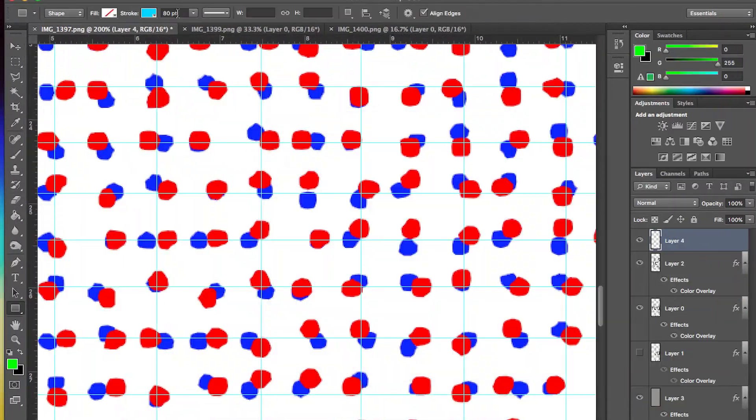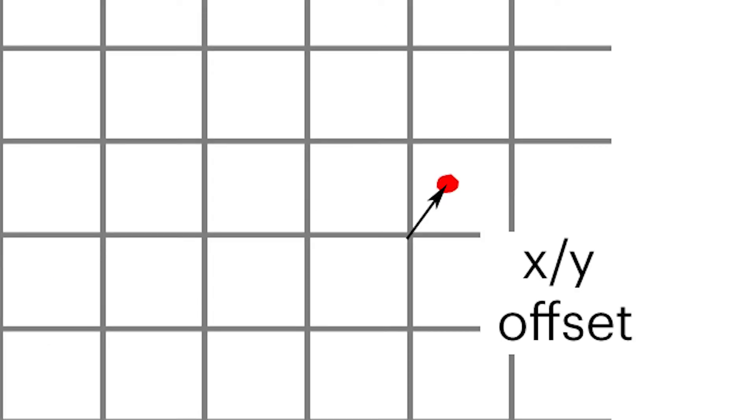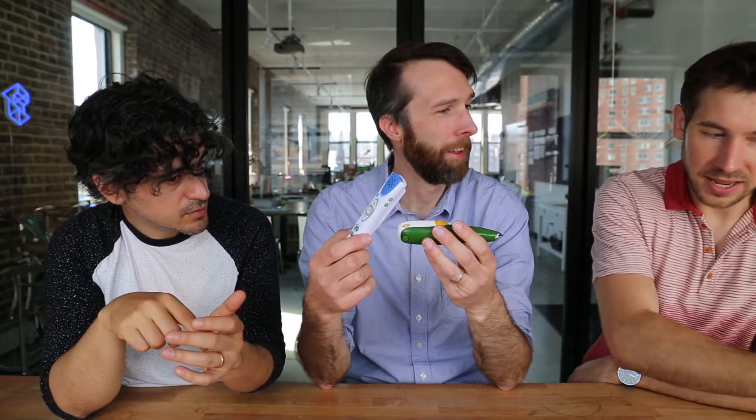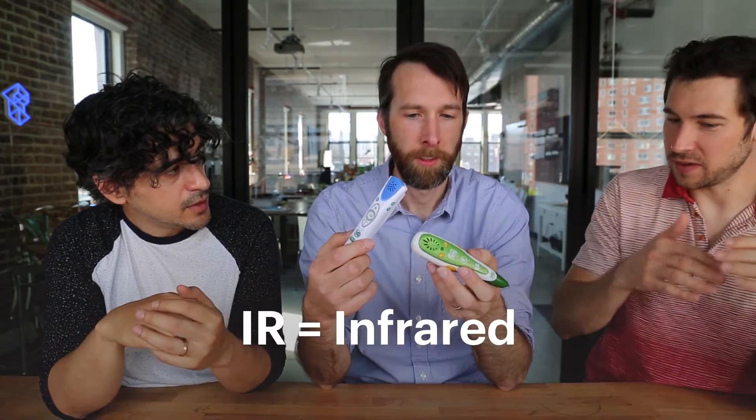So it's creating a grid, and it sees how things relate to that grid, and then it appears to be calculating offsets of the dots from the grid, and those offsets are computed as a code. After taking a cell phone picture of a page and trying to use the pen on the cell phone, it doesn't work, because that's all emitted light and the blacks weren't being absorbed by the IR, so it fails. You need the printed image — a toner laser printer really does a great job of absorbing IR. I was told you can print your own patterns, so it would be really interesting to see if this can be hacked. You can make your own books. Hey Leapfrog, create a platform where we can make our own books — we promise not to put any swear words in there.